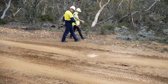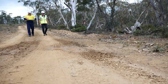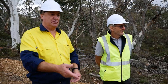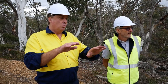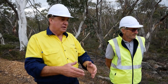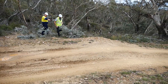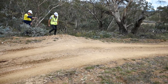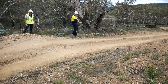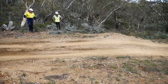The problem with this bank is that there isn't much freeboard at all — sediment has moved down into the bank and into the channel. Without a sidefall, water holds in the channel and as vehicles drive through it becomes a bog situation. When building these rollovers we want as much freeboard as possible for vehicles to cross and for the longevity of the bank, and also a little bit of sidefall in the channel so water drains out onto the natural vegetated area to prevent further erosion.